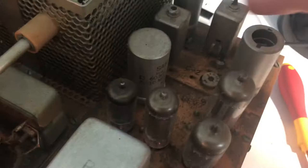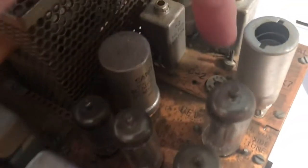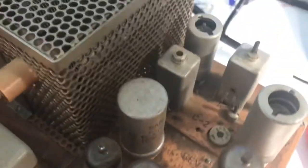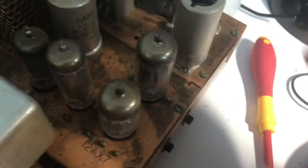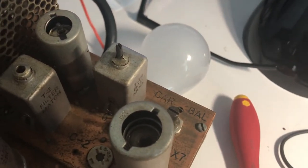I didn't have to touch these cans at all. Those can be tuned for peak so this matches the filter — there are two cans, one filter-match can here and one there. You tune those for max for the SSB filter. This one you tune for sideband balance — equal on upper and lower sideband — and use an SDR to check it. An SDR is only $30, so you can afford to get an RTL SDR for $30 and tune your rig this way. Once you get the sideband sounding the same, go to SSB, take the RF all the way down, and tune for null carrier into a receiver and you're all set.